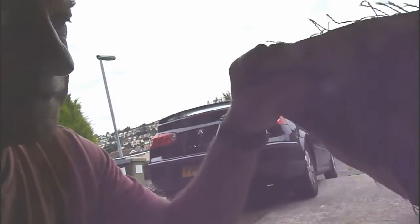There are other things that you could need. If you're against a wall, you will need one of these cloths. This is a heat cloth. You can see where I've caught it before, but it's to stop things getting alight, like your wallpaper or wood, or if it's up against a cupboard. And there's another heat cloth, a bit thicker one again, that I used on the bottom of that. So you may need those as well. It's got to be worth it to you, if you're doing a fair bit of plumbing, to get those sort of things and do it.